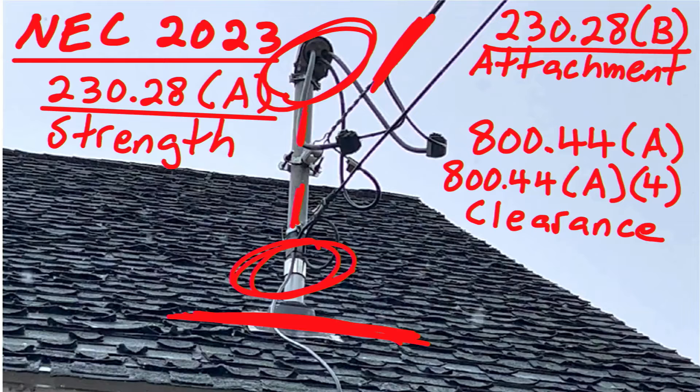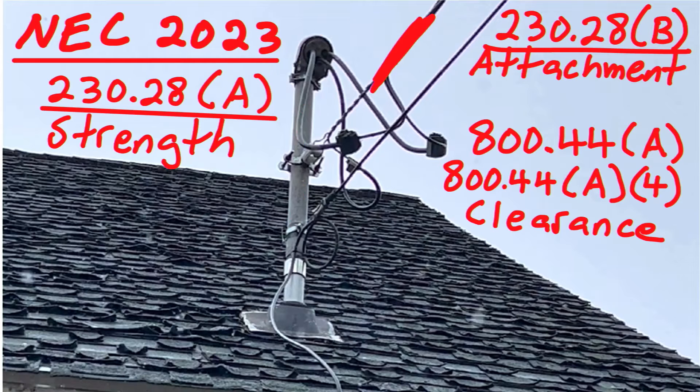Also below where it's on the building, there must be straps — it must be securely fastened. The code continues: or other structure, or is located above the building or other structure. So, looking at this as common sense: we've got the point of attachment over here pulling this way, and we've got this coupling down here — that's a weak point. We're not supposed to have a coupling below the point of attachment.